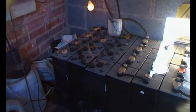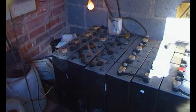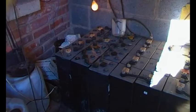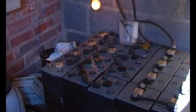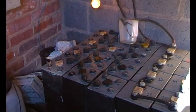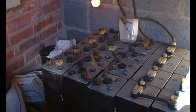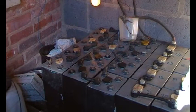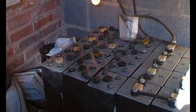They were all even as far as specific gravity is concerned, but they were all quite low, so they've been on trickle charge for about three months through that bulb. What I wanted to show you is what happens when you trickle charge batteries that have come out of forklift service. What tends to happen is as they charge up really well — and they have done for three months — the specific gravity tends to go through the ceiling.